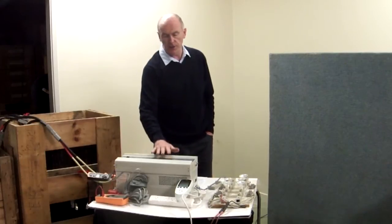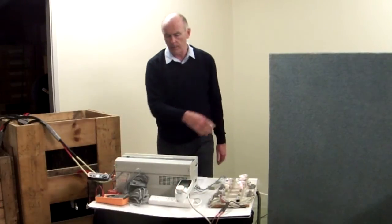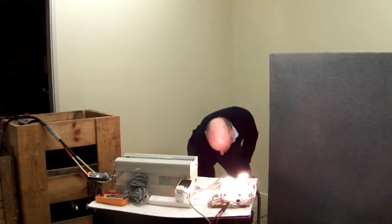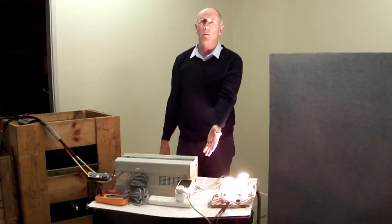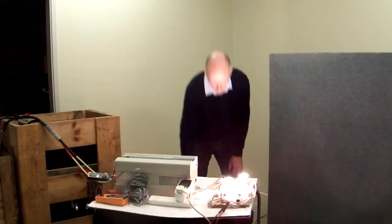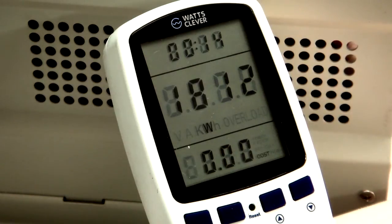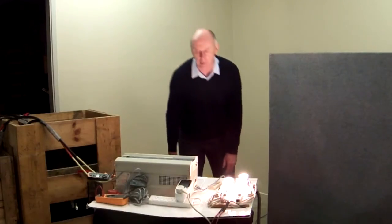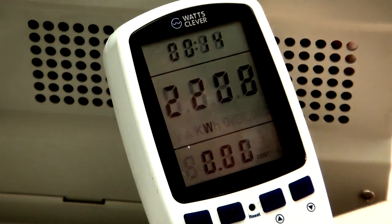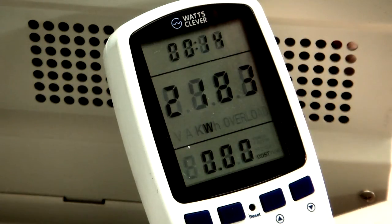One of the big advantages of this type of inverter — I'll put the load on now. I'll just plug the load in. It's only about 250 watts of load. I'll crank that up now. You can hear the fan automatically come on because now it's pulling around about 1500–1600 watts. We'll push that up further — that's now around about 1780 watts. Now we're pulling around about 2200 watts, and this is only a 2000 watt inverter. So it handles the overload with a lot of ease.